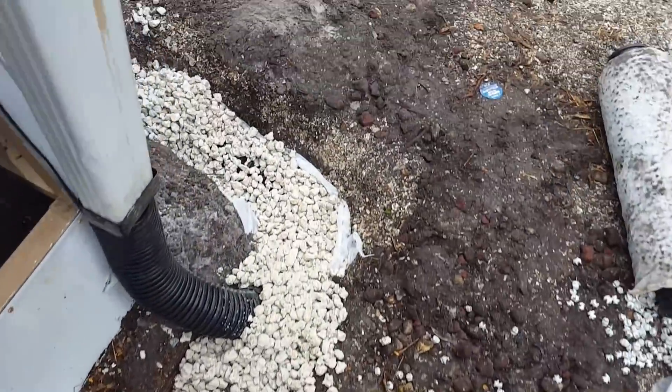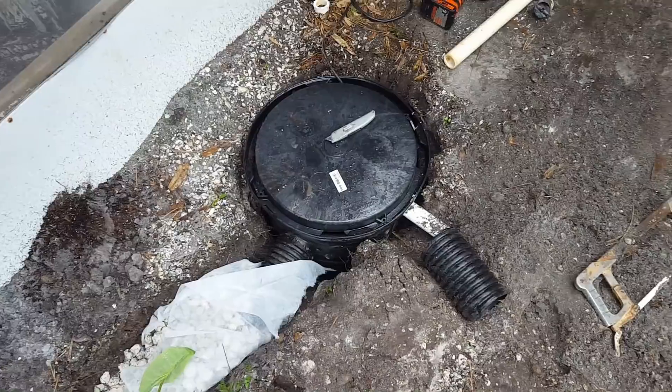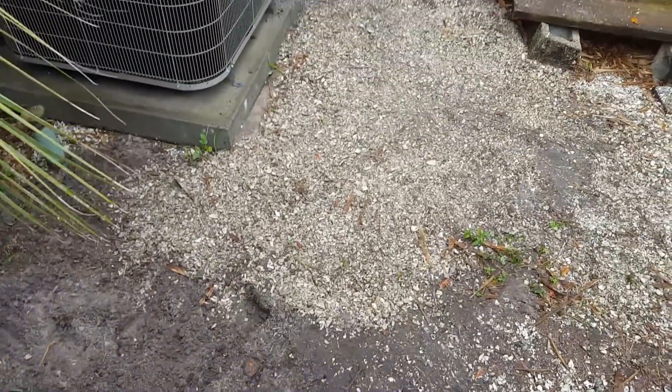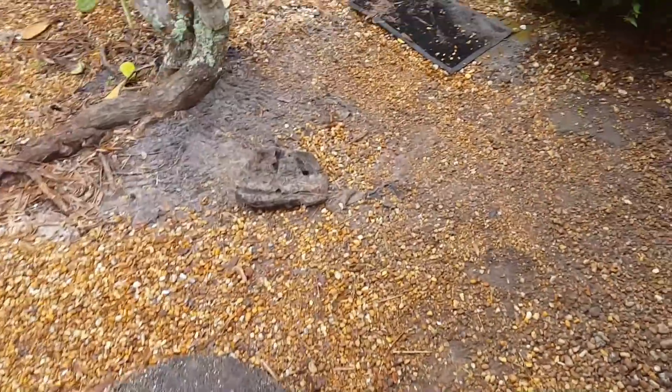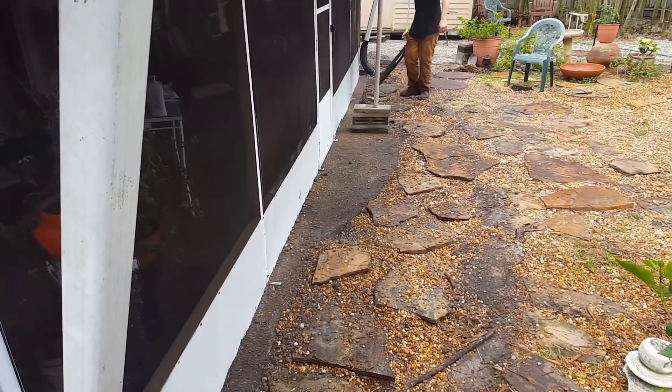All we need to do now is finish covering everything up with a little bit of touch-up. Remember, all that water comes into the sump pit, the sump pump lifts it up, and inch-and-a-half changes to two-inch and runs all the way around to the front. We're finishing up, blowing off that little bit of footer where there's some excess gravel. You can see how the finished product looks. If you do this yourself there's a lot of labor, but you can definitely do this in a day. Hey, this is Chuck with Apple Drains reminding you that if you believe you can do something, I guarantee you can do it. Have a great day.